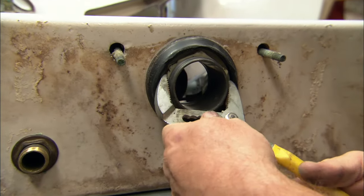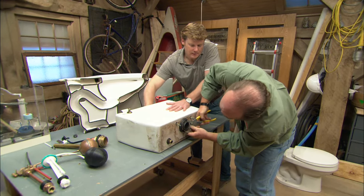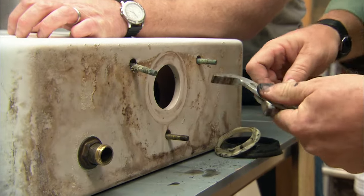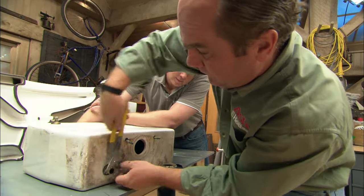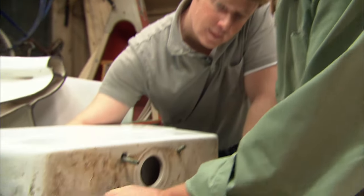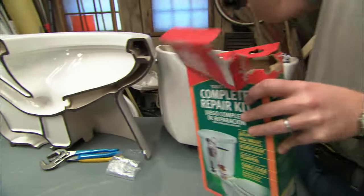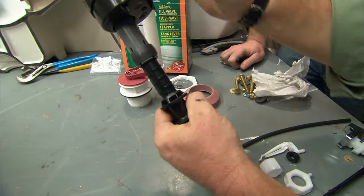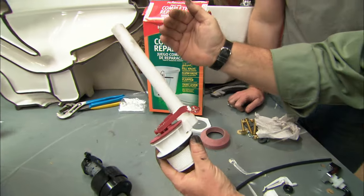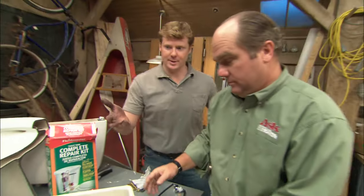There's a large nut here for the flush valve — take that right out. Then loosen and pull out the fill valve, push the bolts through, and we're ready to rebuild. This kit has everything we need. Here's the fill valve — you can adjust its height depending on the size of the tank and the height of the float. This is the flush valve, and if it's a really short tank, you may have to cut down the overflow tube. Other than a few adjustments, it's a universal kit, and it costs about 20 dollars. At that price, it makes sense to change everything.